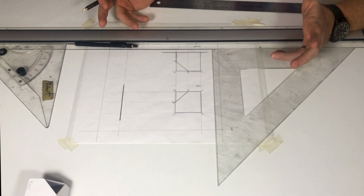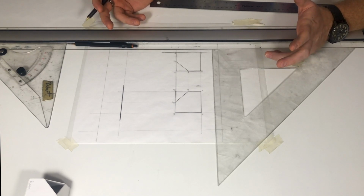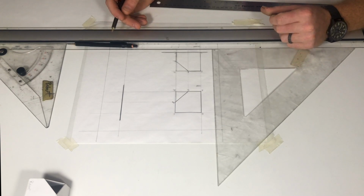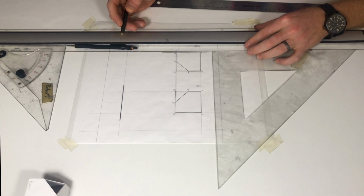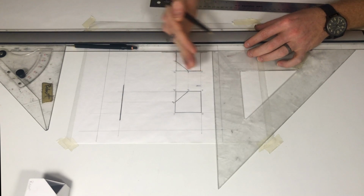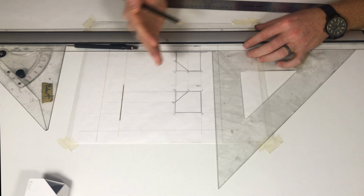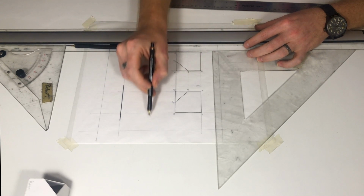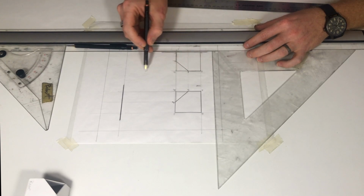One of the trickiest things, I think, that happens here is that it can be confusing of where do I start my hinge, right? And actually you can pretty much do it from anywhere, which makes it even more tricky, but also gives you a lot of freedom to design how the drawing works. Now, in the very simplest way, I like to start from a reference corner of the object to the inside of the rotation. So if I'm bringing this view around to here, the inside corner of the rotation would be here. Now I could hinge right here, somewhere arbitrarily in space.